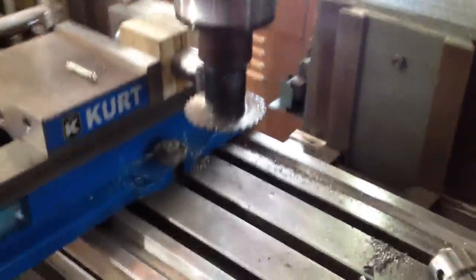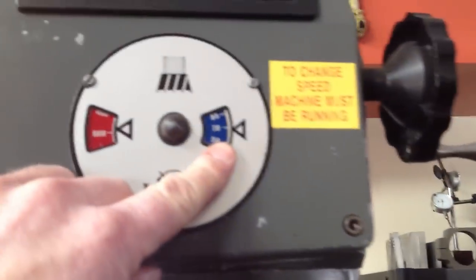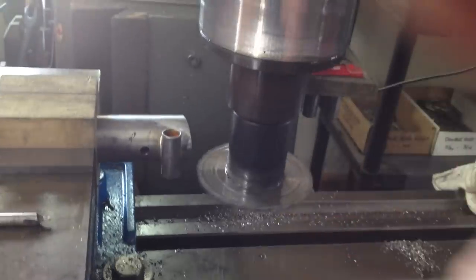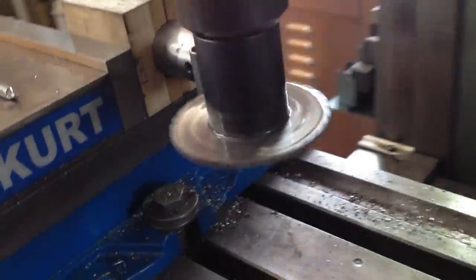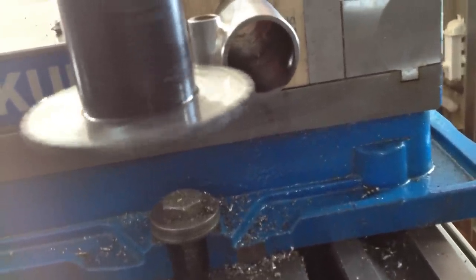It's time to slot this setup, so let's get going. We're going to pull back, get the machine turned on, and start cutting this slot. I'm running on the slow settings — right around 70 RPMs for this process. I'm going to add a little bit of cutting fluid to my wheel, and we'll start sliding the tube in. We're just going to advance in gently to make a small rough edge.